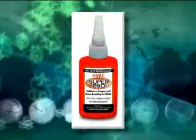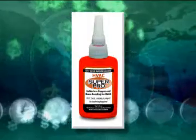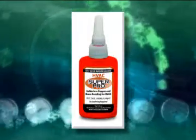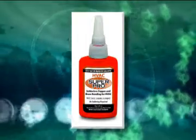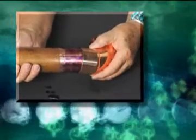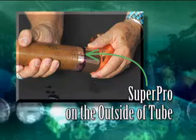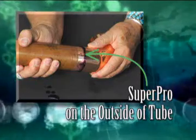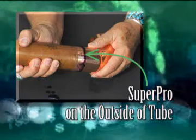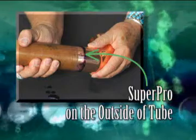When either of these is performed, the small amount of liquid seals the inside of the tube with a micro-thin solid bond that even the POE oil will not strip away. The Super Pro on the outside of the tube will not harden and can be wiped off after the 3 or 5 minute mandatory bonding time. Super Pro is an anaerobic and only hardens between the connector and tubing.